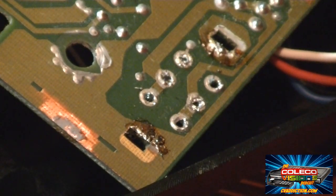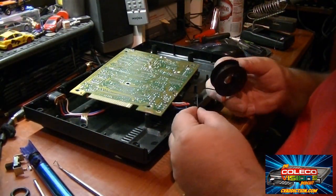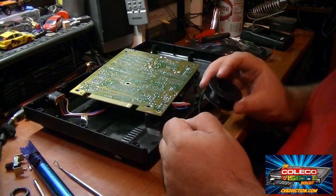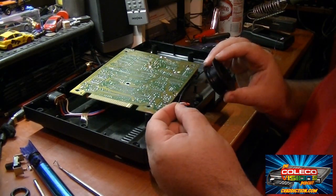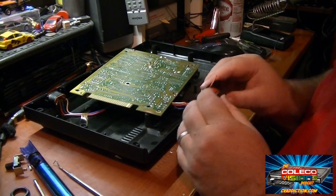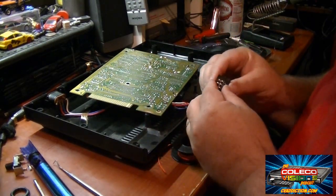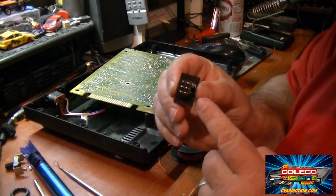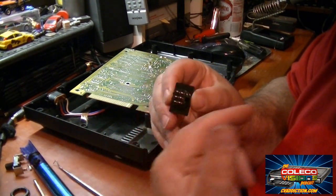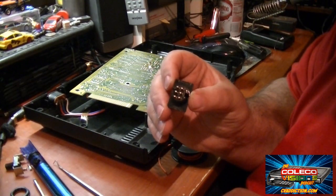take my new wires for my new switch. Now I'm going to cut my wire to go between the switch and the circuit board. Now what I want to do is for one side of the switch, for one voltage leg, I'm going to use black wire, probably for the 5-volt supply. And then for the other side of the switch, for the 12-volt leg, I'm going to use orange wire. So if I connect on back of my switch here, orange here, black there, I don't have to worry about them crossing over. So it's good to color code your wires to make sure you don't make the mistake.